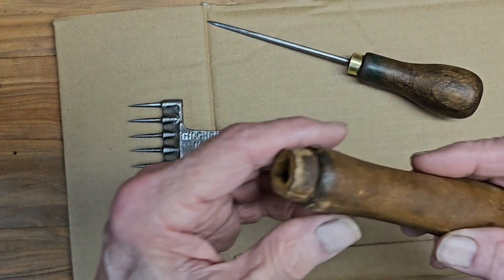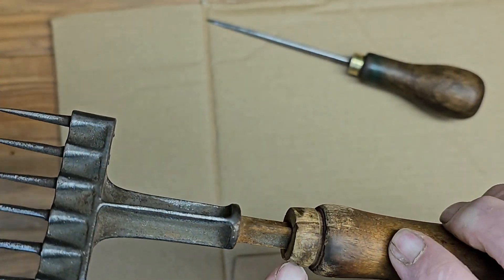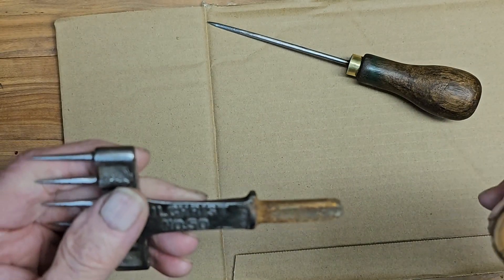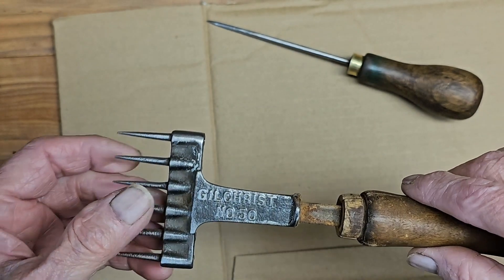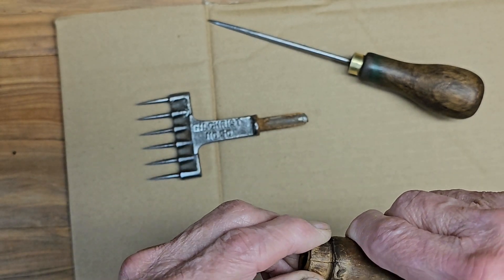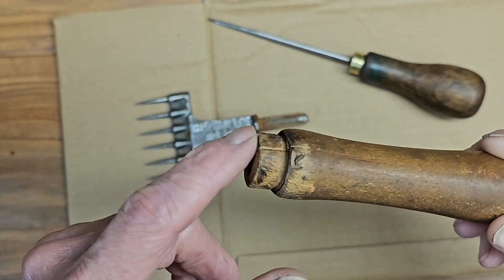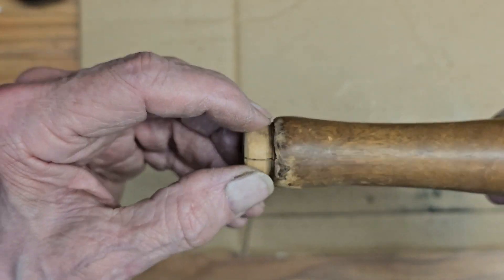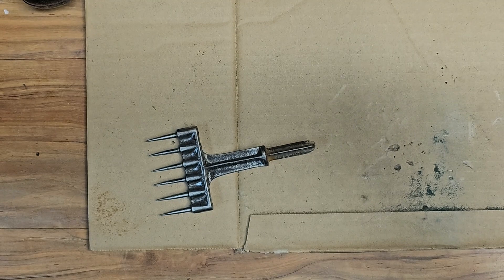I got to looking at the handle here and it was splitting in several places and cracking on down into the handle, so that's going to have to be pulled together and glued. I don't know if there was a ferrule on here, but it's just bare wood — it looked like there was one on here but it's broken off or gone. So I'm going to have to make a ferrule to fit on here to hold this together, and also that wood is not going to finish very well with the big cracks in it. In addition to refinishing the handle, we're going to have to address that.